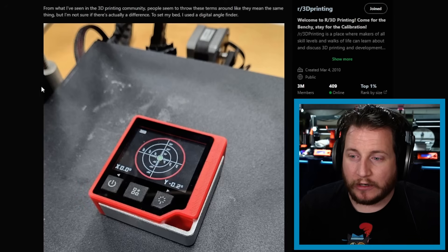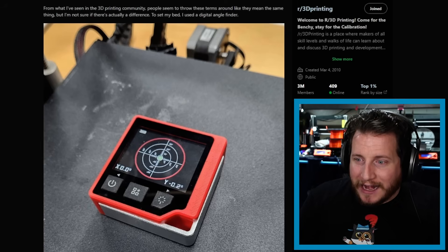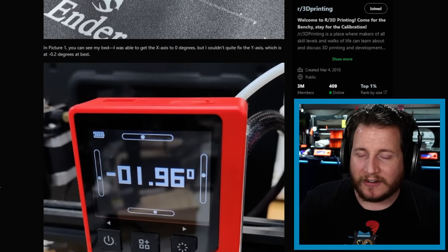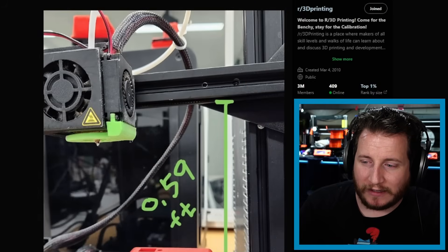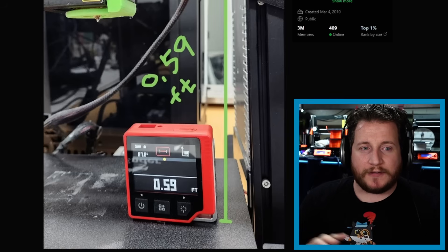If you were to actually level your printer, your printer also has to be on a level table on a level surface — leveling is weird. What you're actually doing is getting your X-axis to be perpendicular to the vertical uprights — this is for bed slingers. Once you do that, you need to adjust your build plate to be at the same distance all around from the nozzle. Using an angle finder or plumb finder here, while they found that the bed is only off by 0.2 degrees, their X-axis is off by 1.96 degrees — and they're not taking into account the actual table and surface.